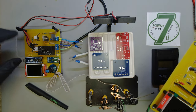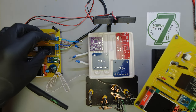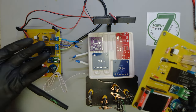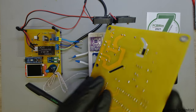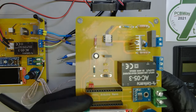I added an acrylic plate to the top, as you can see it's shining and reflecting things - this is just to avoid touching anything on the live part. I also added one at the bottom to avoid anything touching the back of the PCB and shorting things out.